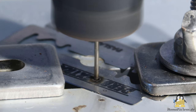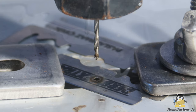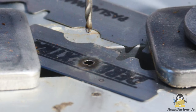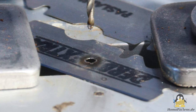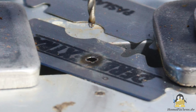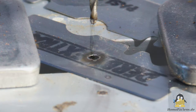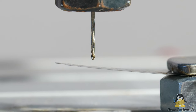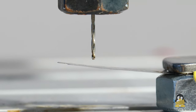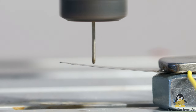This continues until the razor blade is pierced by the drill at some point. My experimental setup works in principle. The drill penetrates a very hard metal almost without contact, which it only scratched a little in the classic way. While drilling another hole, the razor blade is only clamped at one end to show that the drill bit just strokes the steel slightly every now and then during the process.